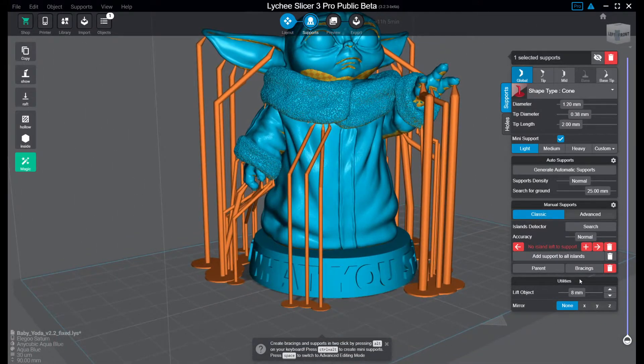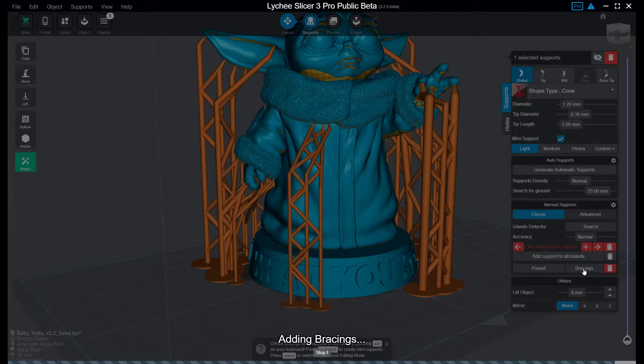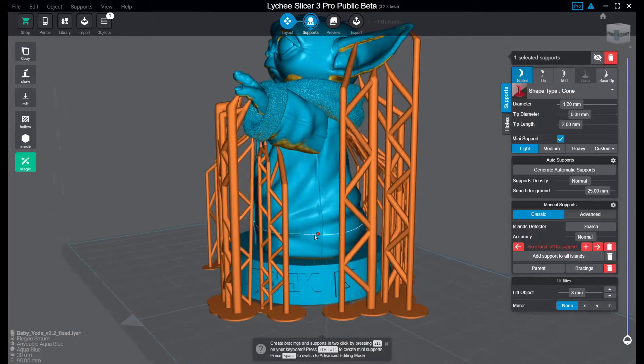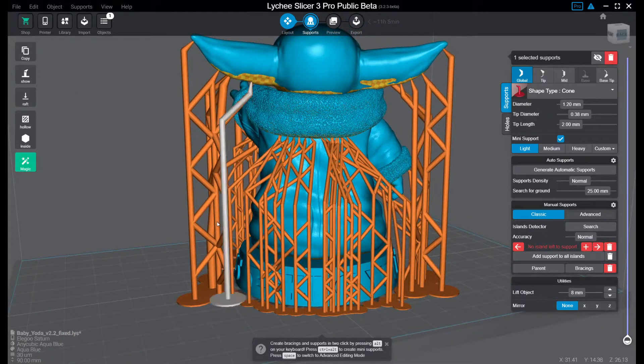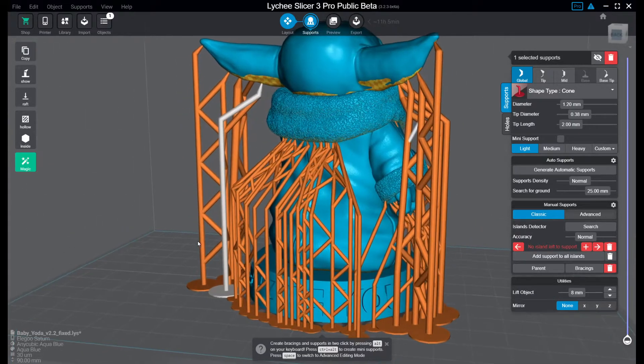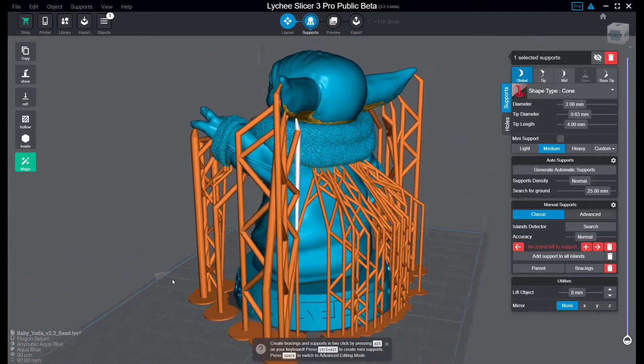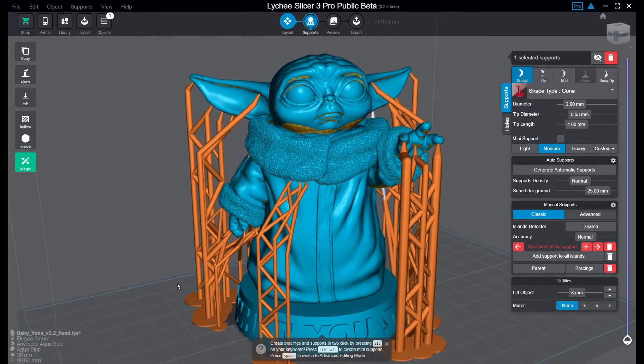Now I think we're ready to create some bracings, and I like to use the shortcut. When you put your mouse pointer over the button, you get an idea of what it does. 219 bracings added — these actually help a lot with stabilizing. You get kind of a scaffolding instead of long thin pins. You can also do it manually when you feel that it needs some support: you push down the Alt button and just draw them between the parts you want to brace. There is one that feels kind of lonely, so you can actually extend and enforce the supports really well.